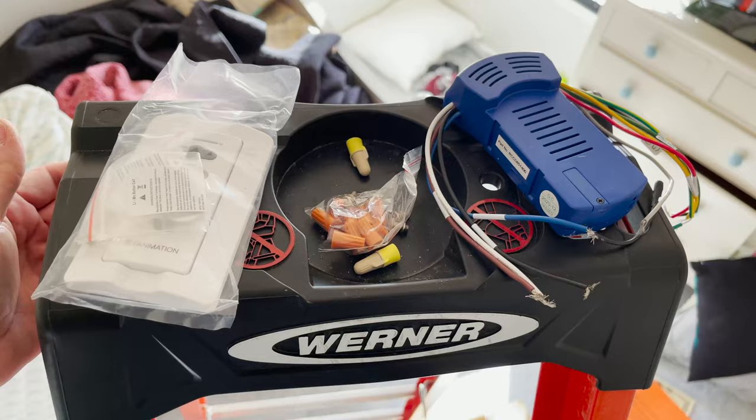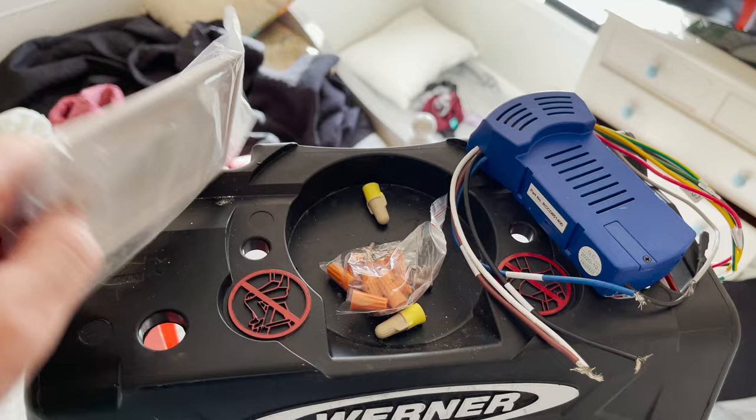Now that you've got everything in place, it's time to put the module in. Some fans don't have modules — they're just three wires: black, white, and blue. If that's the case, the blue is for the light kit. If you have a switch on your wall for the light and a switch for the fan motor, you would put whichever switch goes to the black — black is typically the motor, blue is typically the light inside the fan. A lot of times they'll have a little sticker that says 'to motor' and 'to light,' and the neutral for both of them just goes together. That's the typical switch-operated fan setup.